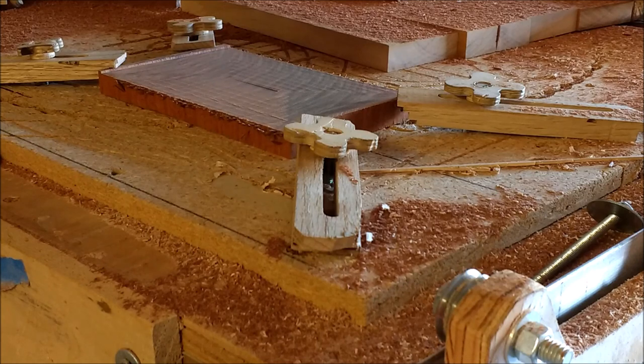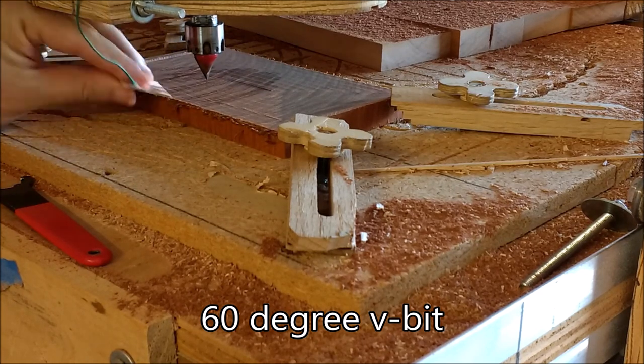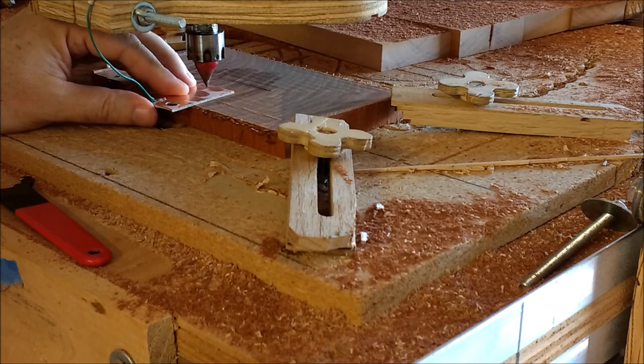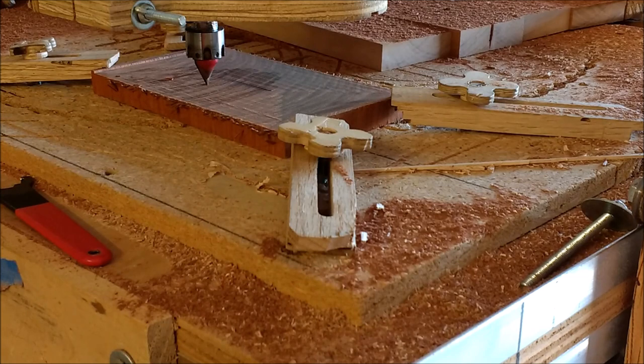Change bits and go to the next step. Re-zero again. Cutting these V60 slots — this is hardwood, which obviously is hard, and it's end grain, which makes it that much worse. So I'm doing very slim passes to get less deflection and get it nice and perfect. It adds a few minutes, but it's not that big a project anyway, so it's well worth it.